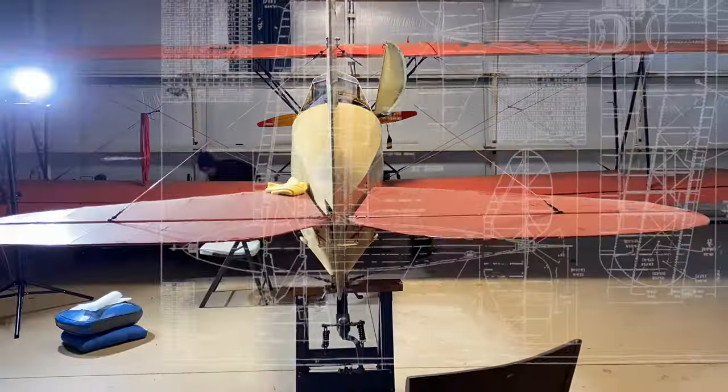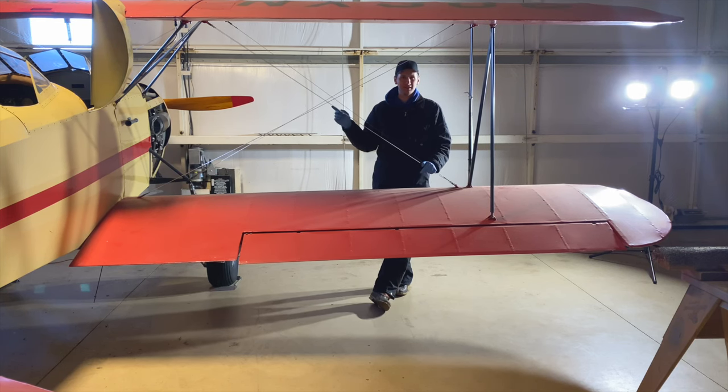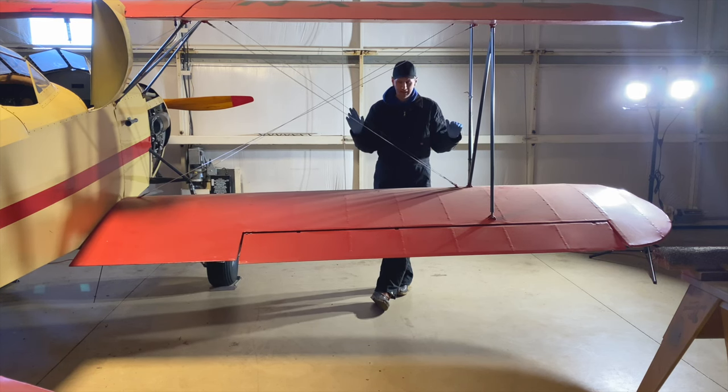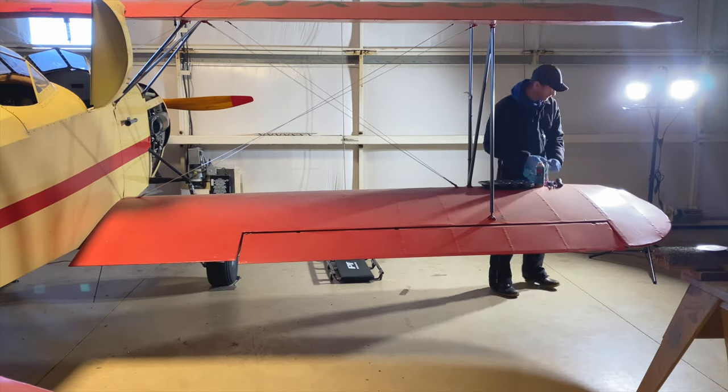We are ready to continue with the inspection of the actual airframe. So far the tail is done, cockpit is done, landing gear is done — onto the wings. The main thing with the wings on this particular airplane is the gas tank is in the top center section, so we have the fuel gauge, all the fuel lines, the flying wires, the struts, the pitot-static tube, and the ailerons on the bottom wing. We'll grab the checklist, check all hardware is tight, lubricate the ailerons, look inside the inspection covers with a creeper and flashlight.